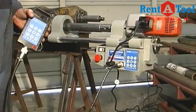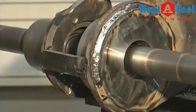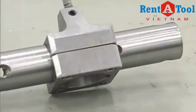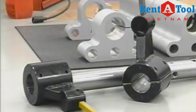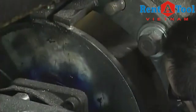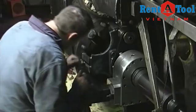And you're now ready to take your first cut. The machine has a 14 inch travel stroke and, depending on the bar packages, can do bores from one and a half to ten inches. Optional large bore adapters are available for bores of 6 to 10 inches, 10 to 13 inches, and 13 to 16 inches. For bores larger, we suggest our 1236 ET boring bar, especially designed for bores from 12 to 36 inches.